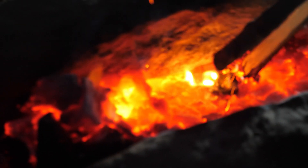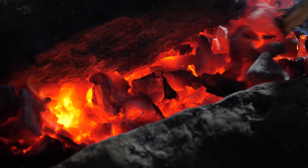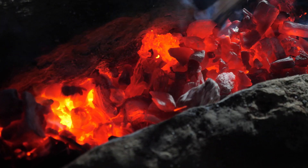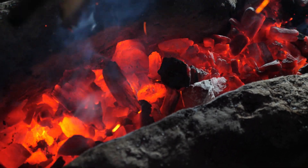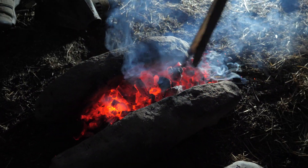These two pieces layered on top of each other in the forge — we're now going to layer charcoal gently on top, then fire it back up, and ideally we will find those same two pieces and forge weld them together. If we can do that, then we can do this entire process with some time and patience using the primitive method. Go for it — turn on the fan.